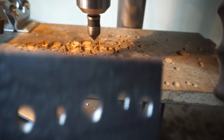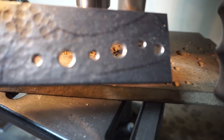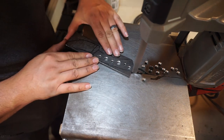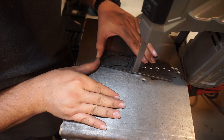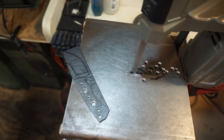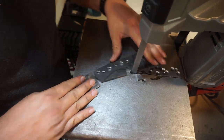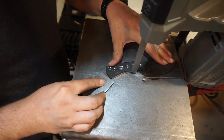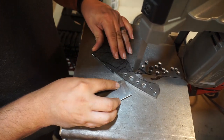When it comes to cutting out my blades, I tend to get 95% of it done on the bandsaw because these bandsaw blades can do plenty of knives and cut through steel like a hot knife through butter. You might as well use it to get rid of most of the excess so you're not wasting your abrasives — the belts on my 2x72 belt grinder.